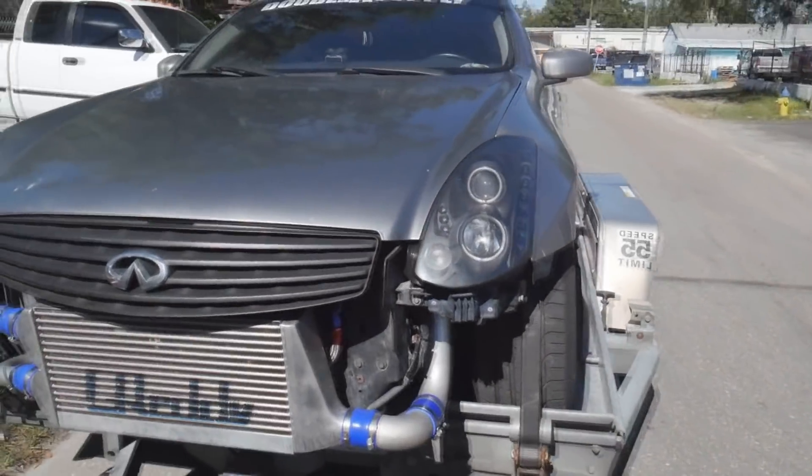The G might smoke a little bit more after rebuilding the turbos. It ended up being a little too high on oil and still spilling oil out of the turbo seals because it was tough for the turbos to drain with the oil level being so high. So I lowered the oil level. It still may smoke a little bit, probably gonna smoke on some rips, but it's fine, it'll clear up. We're gonna go ahead and unload her — got her in her new form, all fresh, all clean.